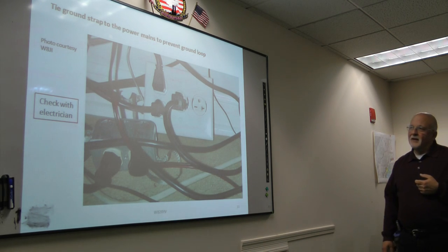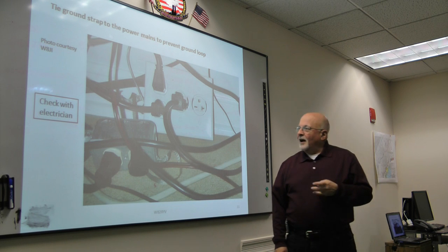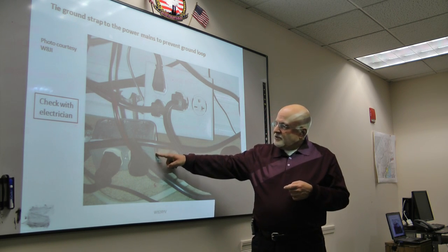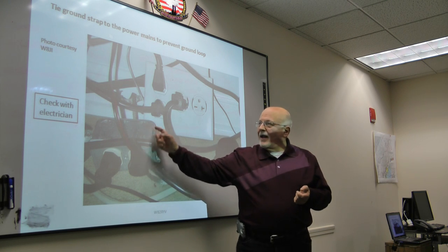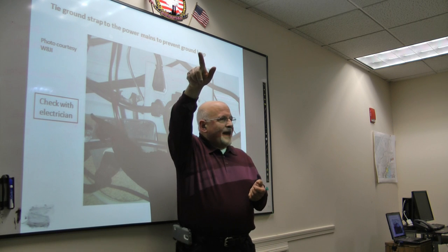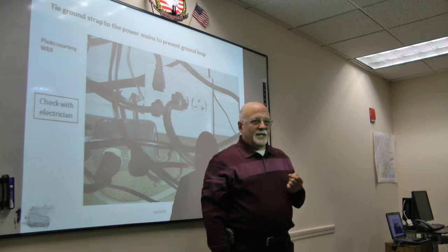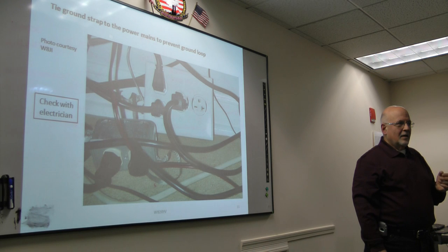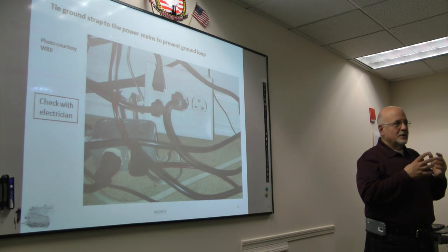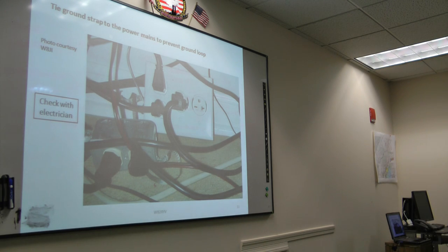This is a guy, W8JI. He has a website. He's got some very good information about grounding. I recommend you look at his site. But what he's done here is he's taken the grounding strap, he's connected it to the ground of the third prong, if you will. That ground strap goes up to his radio and then goes out to his ground. So he's tied all his grounds together, to an outside ground rod. And that way he's got everything on low impedance line, so his grounds are essentially tied together, to try to prevent these ground loops. Anyway, W8JI has a very nice website with a lot of good information. I recommend you read it. That one surprised me, but that's what he's doing there.